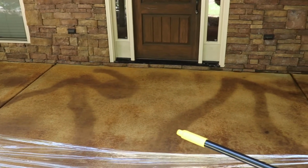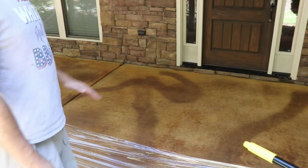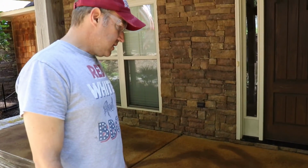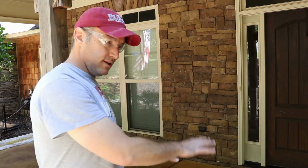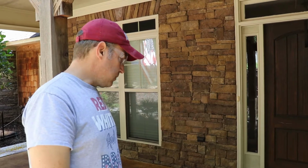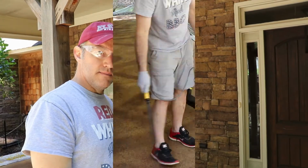So what we're gonna do is we're gonna refill the sprayer with the darker color, the dark brown again, sand brown I think it's called, and we're just gonna spray over everything. Then we're still only gonna wait 2 more hours so that the stain we're about to put on now only has 2 hours to sit. The original stain had 4 hours to sit, so we're hoping it's gonna give us kind of a layered look once it's all finished. So let's reload the sprayer with the dark brown and spray this whole thing again.